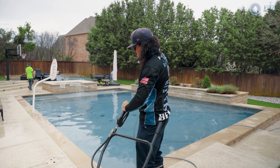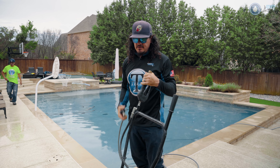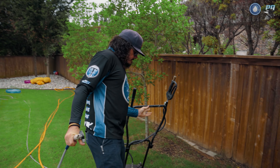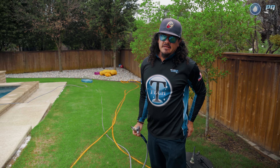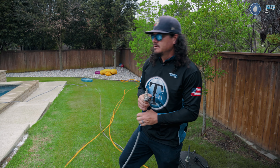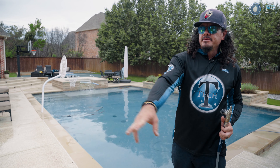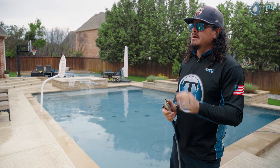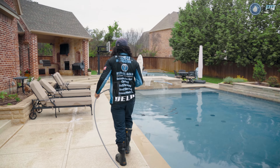Up in a lot of these corners around flower pots and edges, I'll go ahead and use my dual lance pressure washer wand and put a regular white tip on the end of my gun. There will probably be a couple of little areas with some buildup that I'll apply some pressure to, but for the most part I'll just be rinsing. In a couple little nooks and crannies I'll be able to clean with more pressure than a soft wash tip, but not quite enough to leave damage like the last person did. I'll grab my wand.